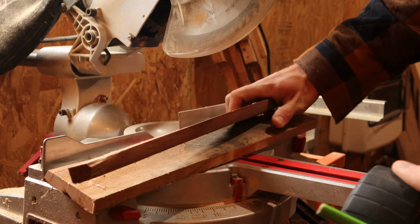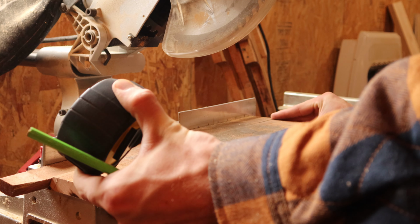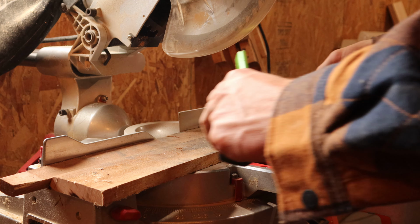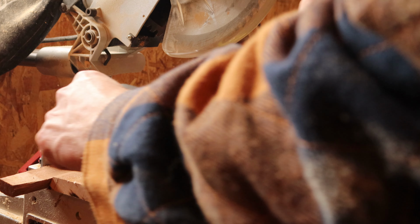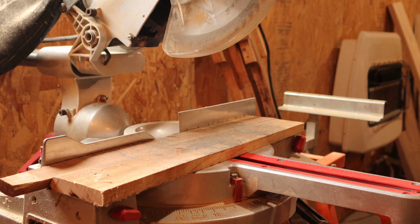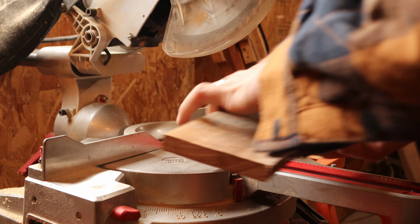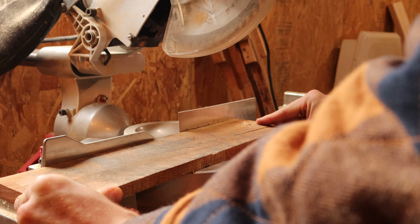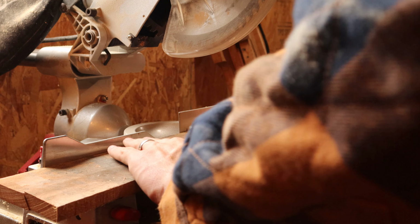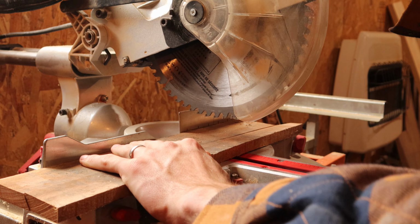So if you have any leftovers that you cracked, but there's still both of the pieces there, just cracked in the middle and it's two separate pieces, this is kind of the perfect project for that. You see here in this clip that I'm basically putting the two back together so it looks like one board, measuring perfectly 11 inches, and then cutting those two boards so they're unison. What I'll do next is I'll staple them or glue them or nail them in their appropriate spots, and it still gives you that kind of rustic look, like, you know, it's split, you can see that it's split. However, it looks good because it is still unison in one piece.